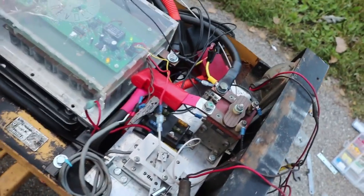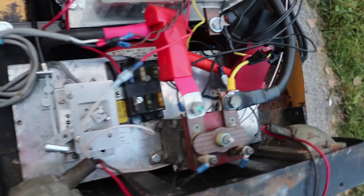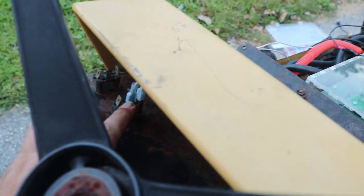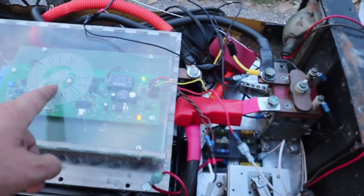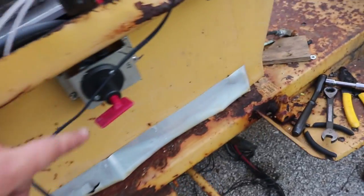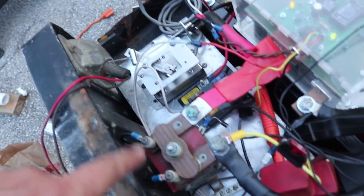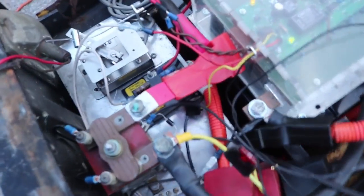This is how far I got today. The machine is basically wired up — not real pretty, I need to clean it up with zip ties, but it's essentially done. Up on the dash I've got the key switch which runs the main contactor, and the old PTO switch runs the logic, turning on the brains to the motor controller. Over on the side I've got the power disconnect — I turn that on, power goes through the pre-charge resistor hiding back there, I wait about 10 seconds, then turn on the power, the contactor closes, and the whole thing is powered up and ready to go.